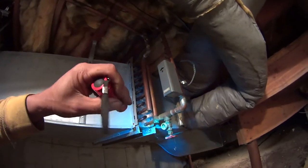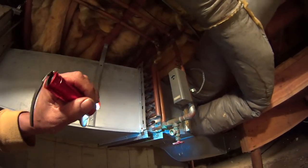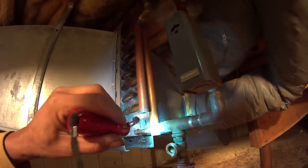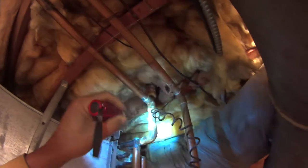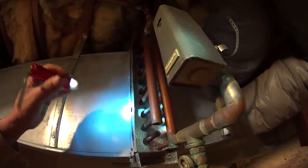It's all filled with water, guys. These things are all filled with water, and that's how — down south they use electric, but over here we use hot water. The water goes through, through here, goes in, then goes up and down, then goes back to the boiler. That's an air vent right there. A little scoop — the air goes by and it spits it out. And this thing gets heat. This coil gets hot and then blows.